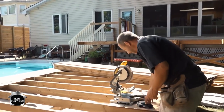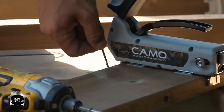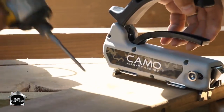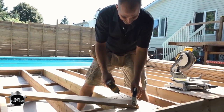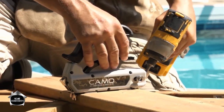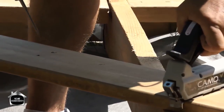We're going to take our CAMO screws. Remember, we're going to be cutting pieces off, so there's no sense putting a screw where it's going to get cut off. Because the board is going in on an angle, if you start too close to the edge you'll miss the joist on the underside. Go towards the lead edge of the board so you get lots of good contact, and stay a little bit away from where the saw cut will be. Drive the drill bit right into the cradle — that sets the perfect depth every time. Then move the gun up a few inches to hit the same joist from the other side. Set the screw, drive until you hit the ridge on the bit, then readjust and repeat.